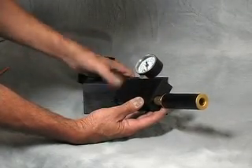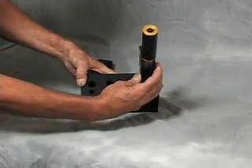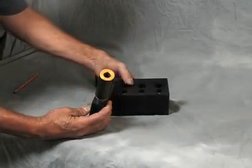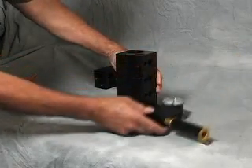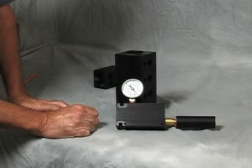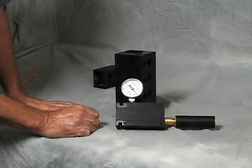If we need 100 cubic feet, we put four pumps on a manifold — two, three, four. And if we need 200 cubic feet, we put them on the back side as well, giving us eight pumps on a manifold producing 200 cubic feet of vacuum flow. So as flow demands increase, we can provide a system for you.